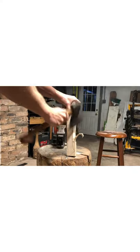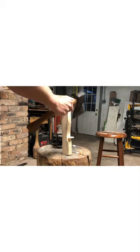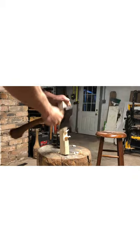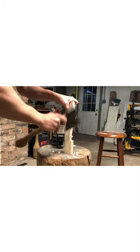You can see where that relief cut terminates the shavings. This prevents me from gouging into the curved part of the handle. This is not completely a fail-safe strategy. If I come through a shaving with too much force, I'll hit that shelf and still ruin the handle.